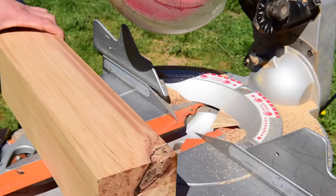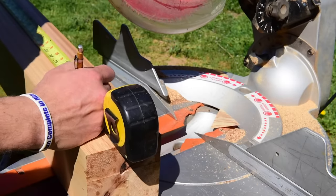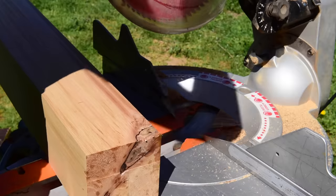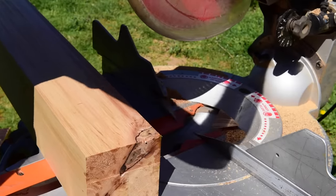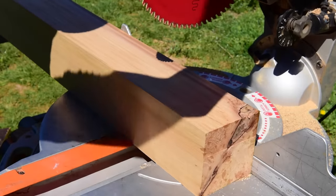There we cut the post to length. I'm doing a 41 inch post overall — my handrails are going to be at about 38 inches. 36 inches is minimum code for the height of deck that I have. Typically it's 42 inches, but I can get away with 36 on this deck because it's lower than a 5 foot drop.